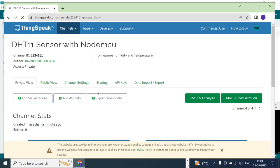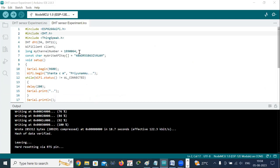After saving the channel, I will copy my channel ID into my program, Control C. This is my channel number. I'll paste it here. Earlier it was something else, now I'll paste my channel ID. Again, I'll go to the ThingSpeak channel, and there I'll copy the API key and paste it here.